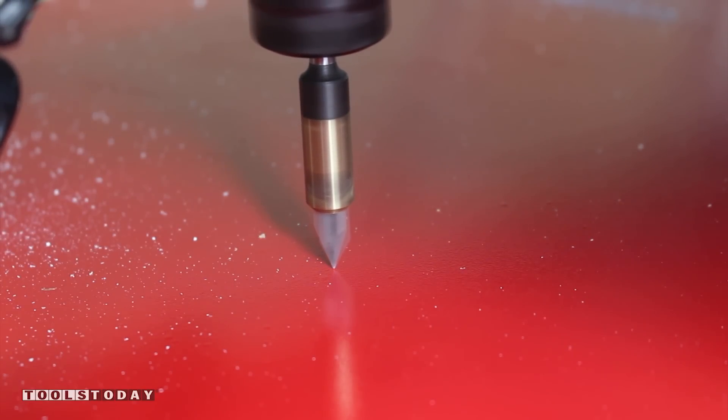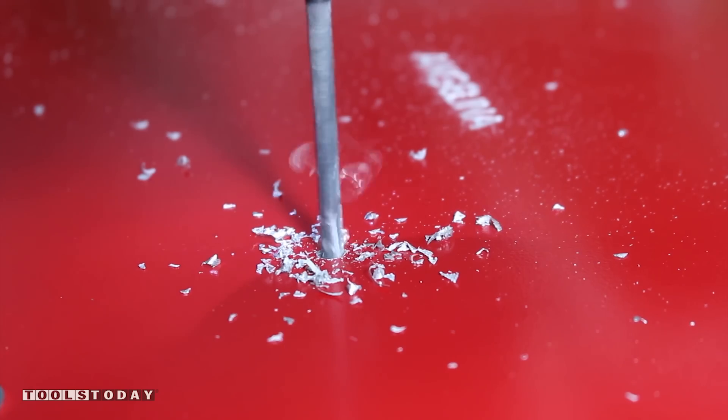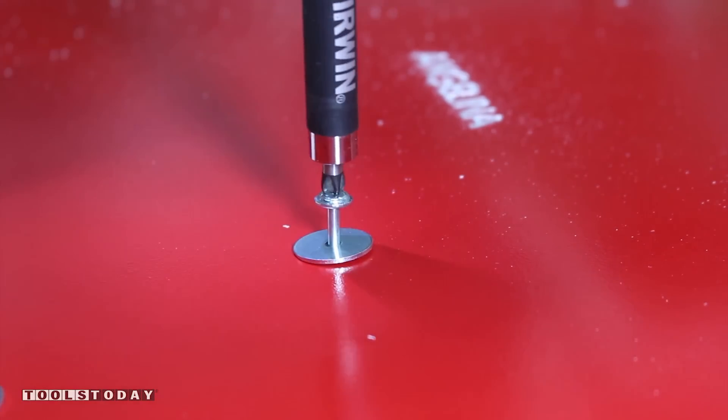When the engraving was complete, I used the V-bit to mark the point where I needed to pre-drill and secure another screw. I used the computer screen and positioned the bit in between the snowflakes so I would not risk damaging the bit. This provided a much more rigid setup and the chatter discontinued.